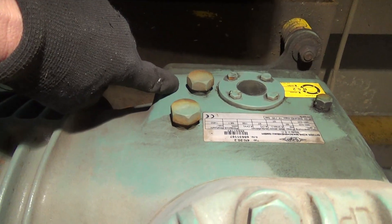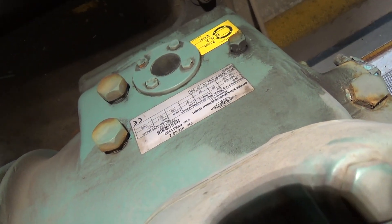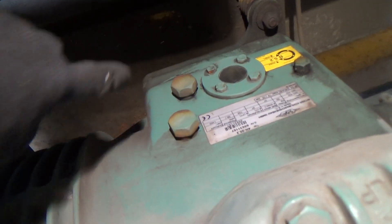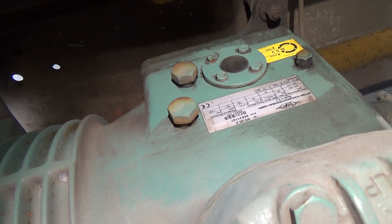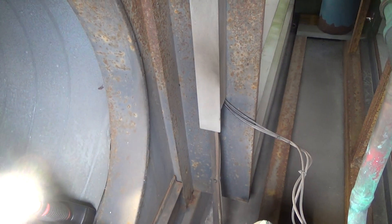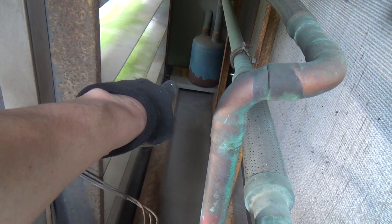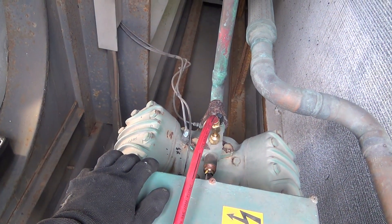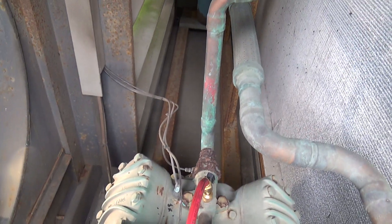So I think we'll get some spray around that and see if it gets any bubbles. That's been there for 25 years without leaking until now — but I have seen thread sealer on these plugs that's dried out. I don't know what they used to do with these plugs — the fusible plugs or sealant they use would dry out after 20 years and leak like a sieve. And then potentially the accumulator — I ought to check that out because that looks prime for the bottom to have rusted out. These could be a big leak, and this system probably holds something like 17 kilos — so about 36–38 pounds — it's a big system.